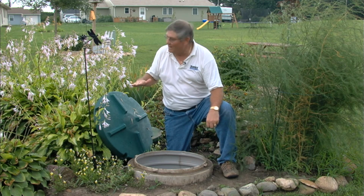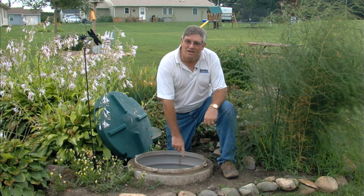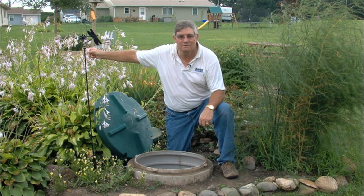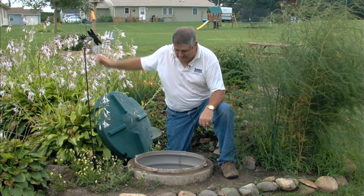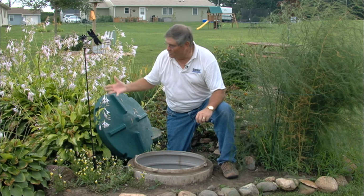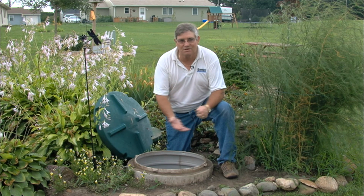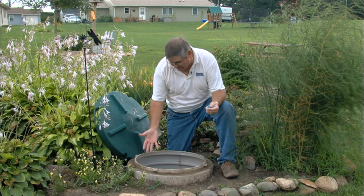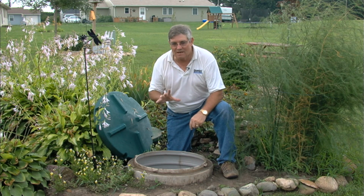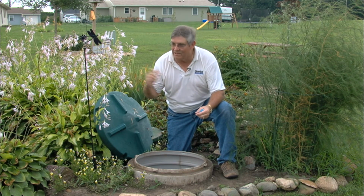If, however, you have a flat lot like this one, you can put a pump at the end of the treatment module, a small pump whose only purpose is to send the flow back to the splitter device or the recirculation device, and that way you're able to keep the whole system underground, and you're able to landscape it and make it aesthetically pleasing. And as far as maintenance is concerned, the only thing you'd want to do here is make sure that the pump is still working, because there's no timer. This is a demand dose pump. It's not a timed pump, so it comes on when it needs to come on. And as long as it's still working, everything's fine.